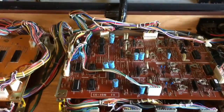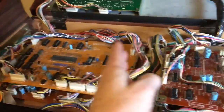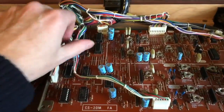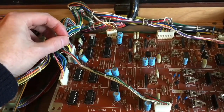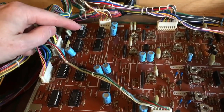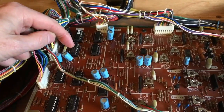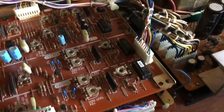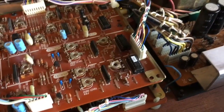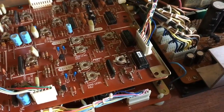And I've moved on a bit actually, because now we've got all the control voltages working. We can finally troubleshoot the analog parts of the board, and troubleshooting Yamaha synths is actually really easy. So what you do is you just put the Yamaha chips on chip beds, and they usually come in pairs or more than that. There's quite a few that you can use to switch around and see which one's the dead one and which one's the one that works.